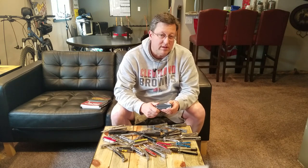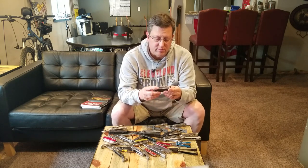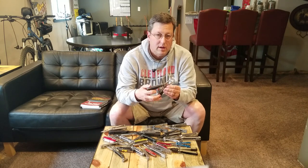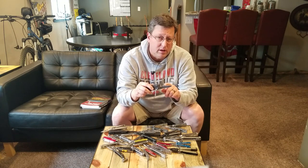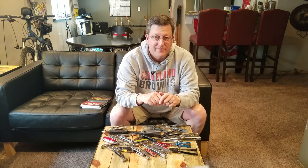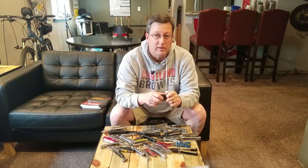Comprehensive multi-tools should give you around 17 to 19 functions. I look for a median price point around $80 US, which will give you one heck of a multi-tool. I like a multi-tool to weigh around 7 to 8 ounces, 200 to 225 grams. I like the option of two sizes of Phillips and straight blade drivers — small and large. I like needle-nose pliers with pipe gripping capability and replaceable wire cutting blades. I like working blades around 3 inches — any shorter makes cutting difficult. I'm not a big fan of serrated blades; they're hard to sharpen at home. And I'm not really a big fan of driver bits — they're something else to lose, but they do offer great flexibility.